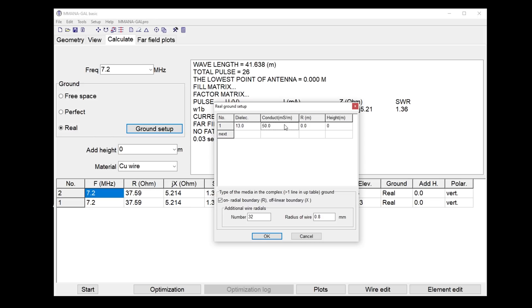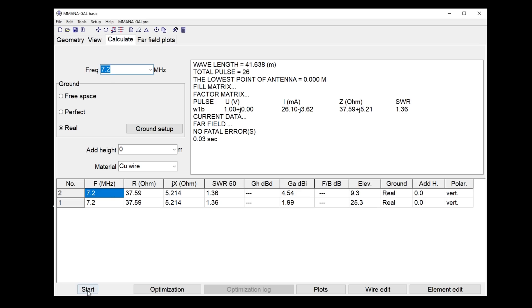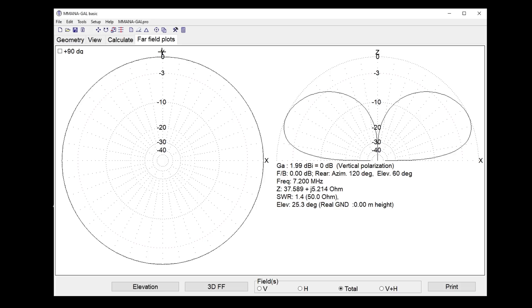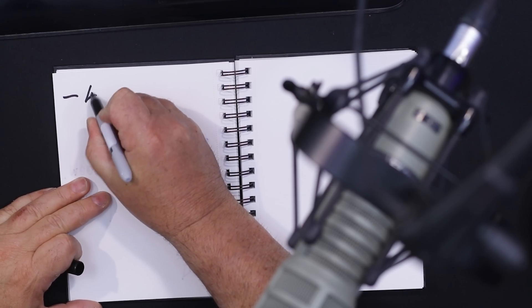Back to average ground — where you grow your potatoes. At five degrees off the horizon, we get minus 4.7 dBi. I'll just write that down so we don't forget. Dipoles and verticals resonate on every odd harmonic, which means you can take 7.2 MHz and multiply it by three, giving about 21.6 MHz.